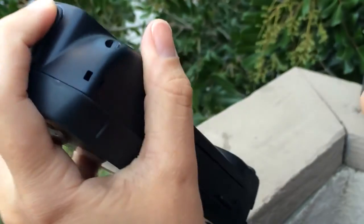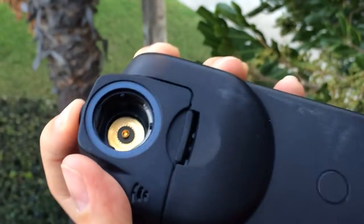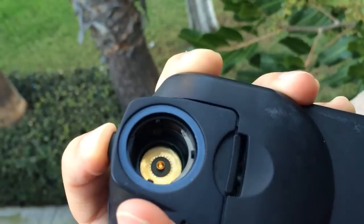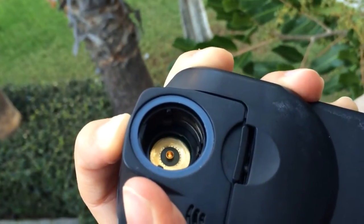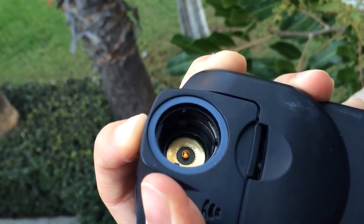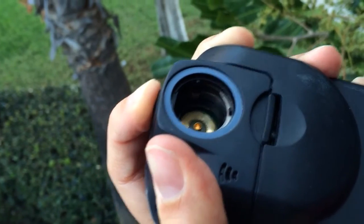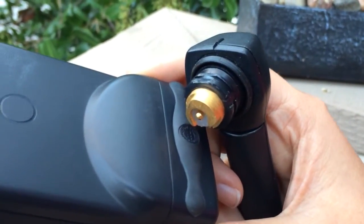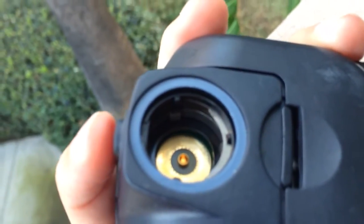Let's go ahead and put the antenna on. Hold that button down and look at the inside while you're pressing it so you can see what happens. You see that copper ring on the inside? There's a solid copper ring and then there's a little copper cup. Go ahead and press the antenna release button — it basically presses down that little metal piece on the bottom. That little copper ring and copper cup is what's making the connection on the antenna. You've got the solid copper piece and the little copper ball end on the antenna that fits right inside that cup.